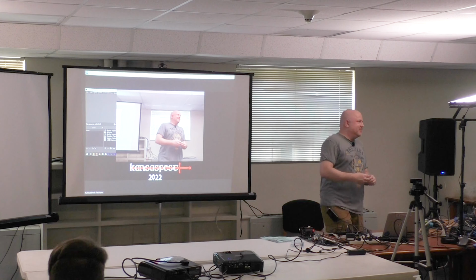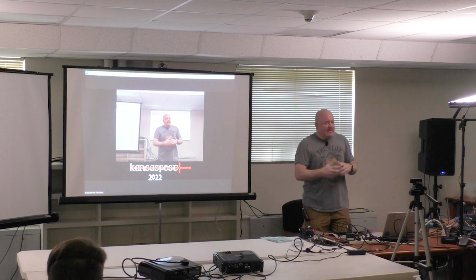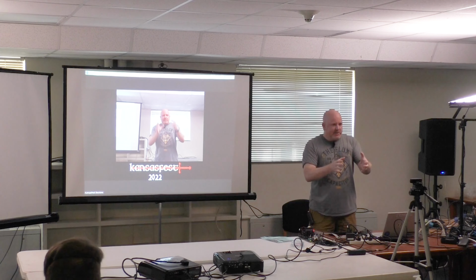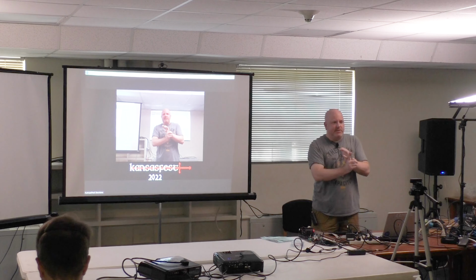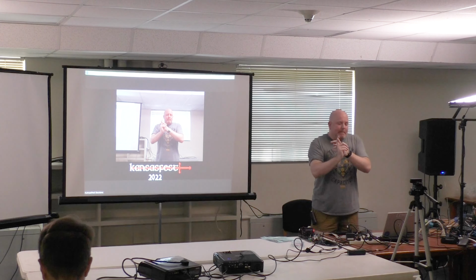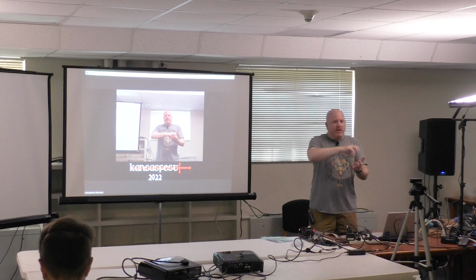That is a great question. It was Ron, yes, sir. Thanks, because I have an excellent reason for it, or at least I think it's excellent. In the Apple IIe expansion card that goes into the LC Mac, the chip on that is called Gemini. If you look around Gemini, you'll see an IWM, a 65C02, a PROM, which I think is for the Mac. The ROM for that chip actually comes over the bus, I believe. There's also a 558 for the game port, and then in the middle is Gemini. So from everything I can tell, Gemini is a follow-on to the Mega 2.